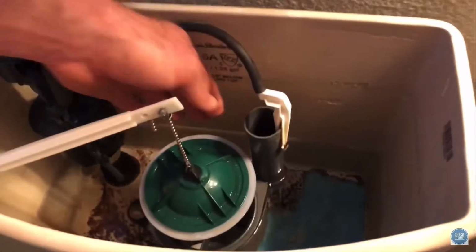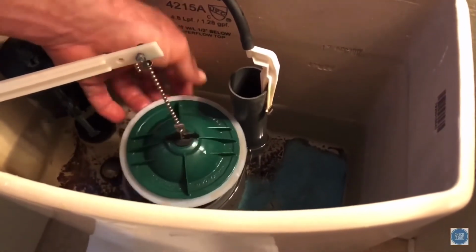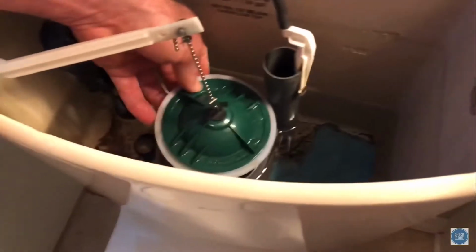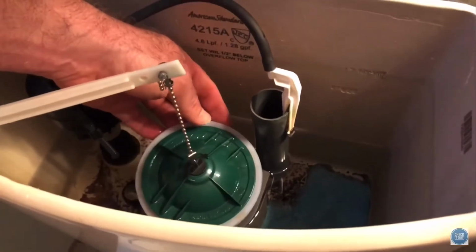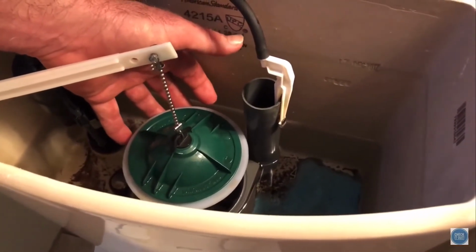So empty the tank as we've done, pull it up, put your fingers here and run your fingers around it, and immediately right here, I feel right where that finger is, there's a bubble. We'll take it off and I'll show you that bubble. Keep feeling around. I've had some of these have a half a dozen, even more than that, of these bubbles. And those bubbles are just enough to lift up a little part of this. Water leaks down there, and that's your problem. So the good news is it's relatively easy.